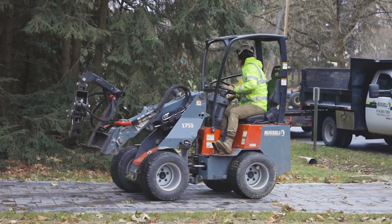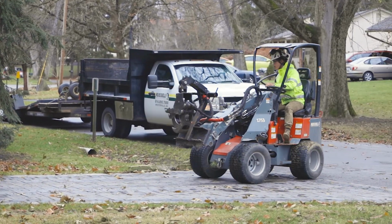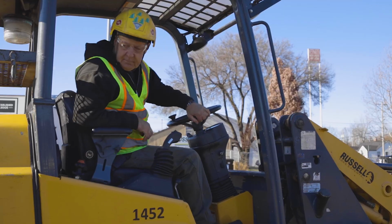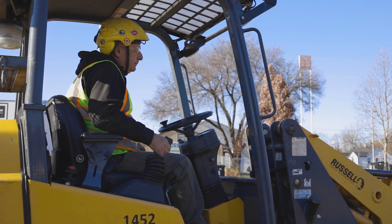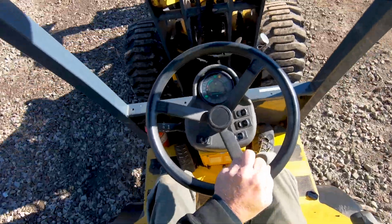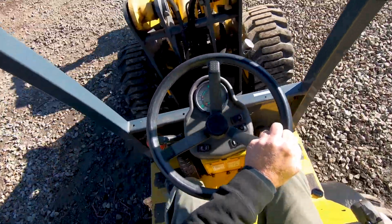While operating an articulated loader, there are many precautions to take in order to reduce the risk of accidents and damage towards yourself, nearby people, the vehicle, and the worksite. Take a look at your nearby surroundings for obstacles or other people before driving the articulated loader. Drive the articulated loader slowly and carefully. It is different than driving a car, so allow yourself time to get used to its different operation.